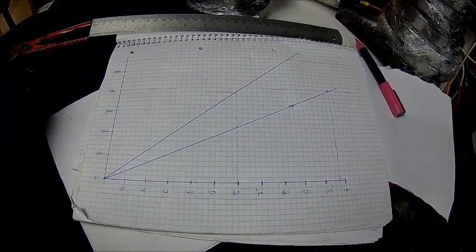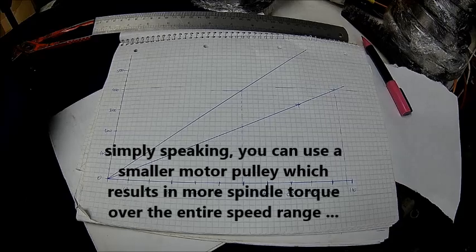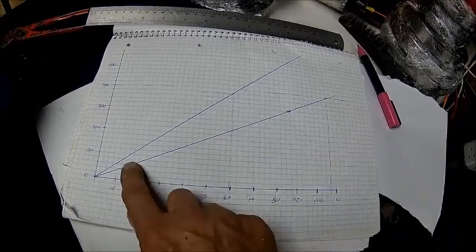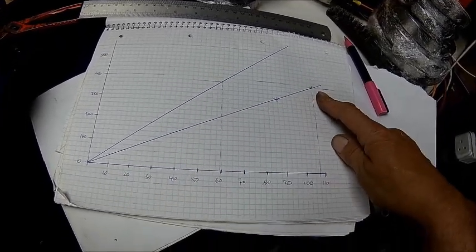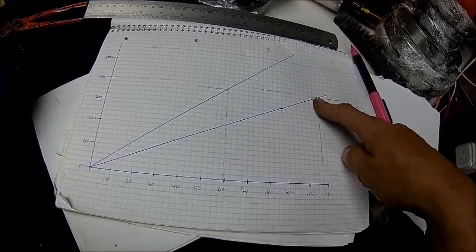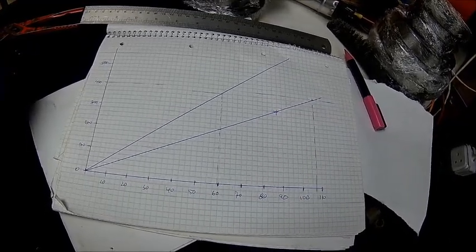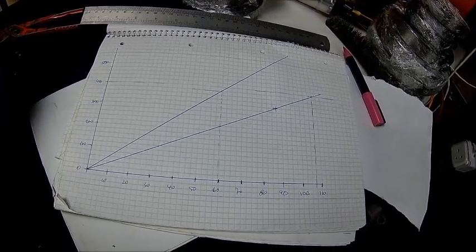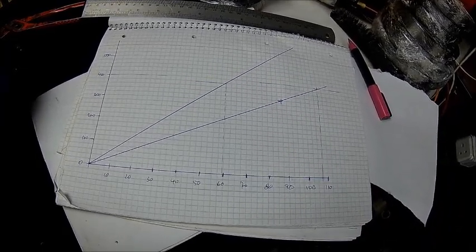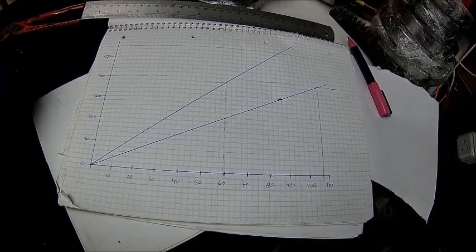To have the opportunity to gear your pulley ratio relatively high, you need some oomph at the top. That's why you get the full speed range from zero to 3000 RPM — with 1500 or 1600 RPM at full torque. So this motor effectively has two kilowatts at a 1.1 kW nameplate rating. The motor is in delta here, this is star. As long as we follow this V/F curve, the motor will draw the current whatever it says on the nameplate — 4.8 amps.